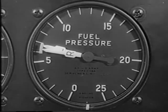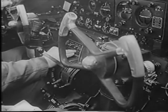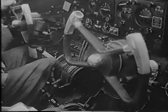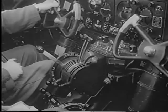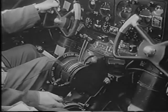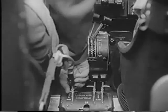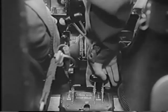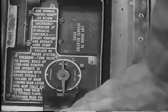It's time now to check your fuel levels. Suction: 3.75 to 4.25. General hydraulic pressure: 800 to 1,100 pounds. Brake pressure: 1,000 to 1,200 pounds. Fuel booster pumps: both on. Fuel pressure: 6 to 7 pounds. Now you're ready to trim your tabs. Trim elevators from 0 to one-quarter degree tail heavy, depending on the center of gravity position. Ailerons 0 and rudder 0. Propeller: full increase RPM. Check mixture at full rich position and lock snug. Lock your supercharger in low. Open the oil cooler shutters. Carburetor air: normal, unless icing conditions prevail.